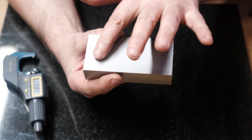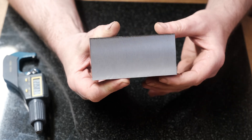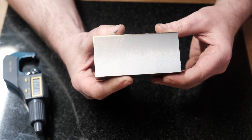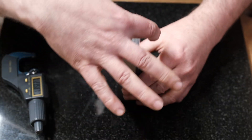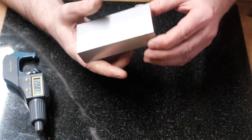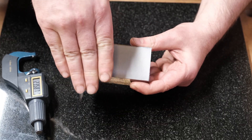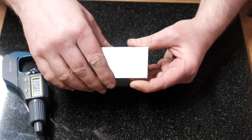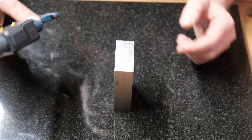As you can see the finish is really good - it's barely rubbing on the back at all. Occasionally it might just rub a little bit but it's definitely not cutting; that's the back of the cutter as it comes across after making the initial cut. I'm pleased with the finish I get on here. I'm going to measure across each of the corners, because with the face mill what you'd expect to see with a big nod issue is that one edge will be thinner than the other, since the face will be cutting at an angle. What I'm hoping is that most of these corners all match up with each other.